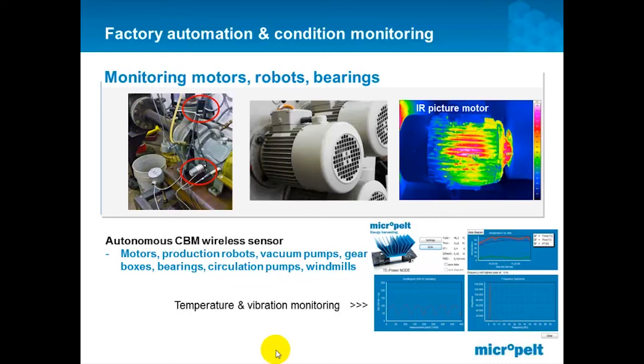And we make many demos, like here. We had a 3D accelerometer integrated, a very simple thing via the serial interfaces, a MEMS sensor to the microcontroller. When we get an oscillogram, we can do an FFT analysis. We have a temperature sensor, right? So it's not even so difficult. And in my demonstrations, this device was active once in 2 seconds. Because for demonstration purposes, I cannot wait an hour. So it was a very simple demo.